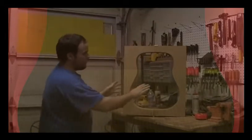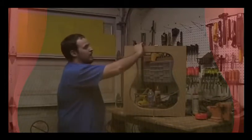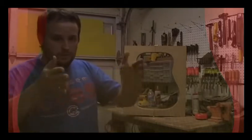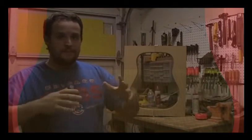The nice thing about this is that once we bend the sides, we're going to be able to lay them in here and grab them with clamps all the way around. This holds the sides to that shape, and more importantly, it holds your sides at 90 degrees. You want your sides to be a perfect 90 degrees to your top plate and your back plate — not only for proportion and symmetry, but for sound and structure. If you have everything at a perfect 90 degrees, when you're calculating things like headstock angle, neck deflection, and where your bridge is going to land, all of that depends on how well that box is constructed. The better the box is constructed, the better it's going to sound.